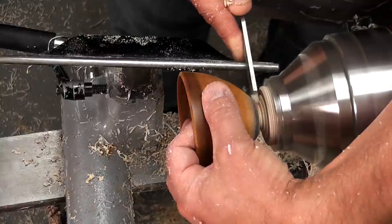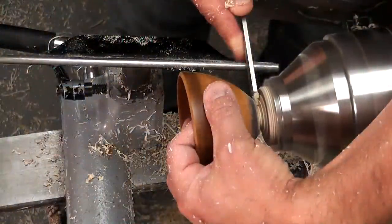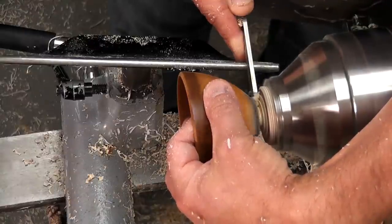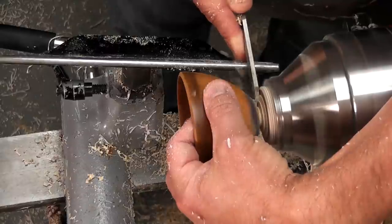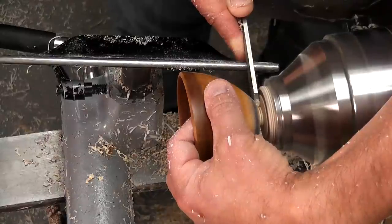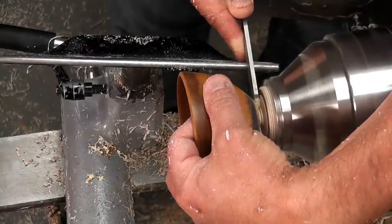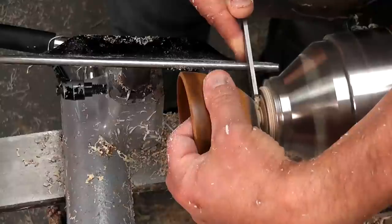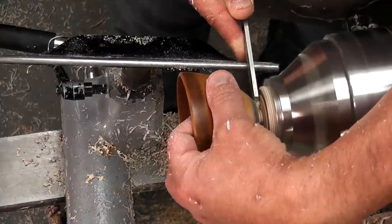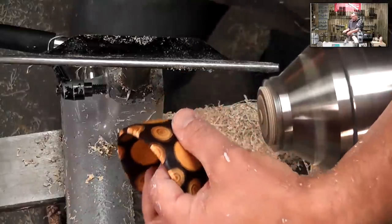Yes, Ben. So a question from James. Would the oil cure on the resin and be a lasting finish, or would you wax on the top? No, I'd leave the oil. The oil will leave a nice finish. And Frederick's asking, would you recommend using the wheel buffing system to polish the bottom? Be careful with buffing. Yes, it does work. You have to get the right compounds. And look at final stage plastics for a compound, which I believe is either the blue or the pink. You'll have to check that online.